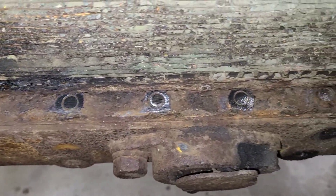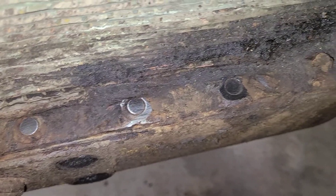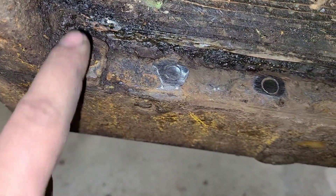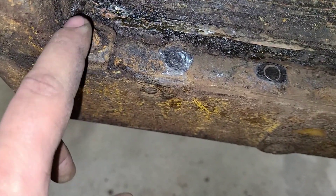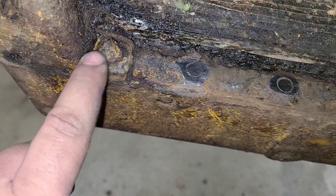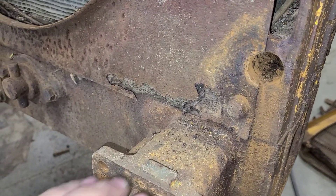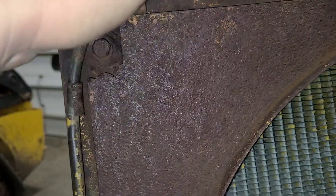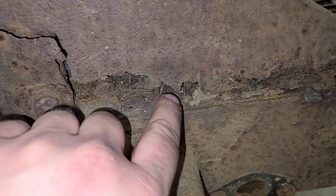Here's what I ended up with. I still need to do that one there and this one on the far left — I'm not 100% sure how I'm going to do them. I might get my die grinder out but I'm just limited with room with the way this casting is designed. Before I break the die grinder out, I'm going to come over here and pull the bolts for the fan shroud. One's already out because it was connected to that oil cooler line. There are a couple that are no longer attached, but we still have to pull the one in the center. The main reason I want to get this out is there are bolts all along the bottom that are also buried in dirt, and I want to see if I have to grind those — hopefully not.